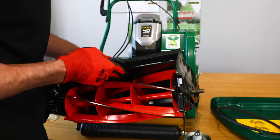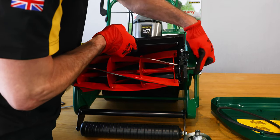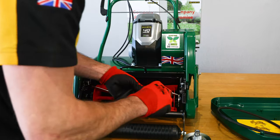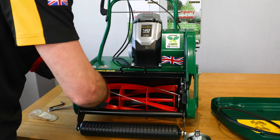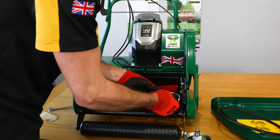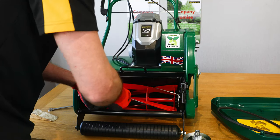To reinstate the cartridge, you will notice there is a rail where the cartridge sits as a guide, and then the drive shaft goes through the cutout on the chassis and slots into position. Secure the cartridge again with the two screws, and before tightening them just make sure both screws are inserted into the threads first.